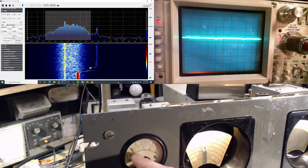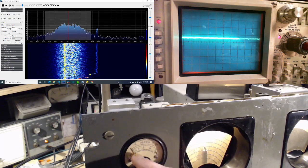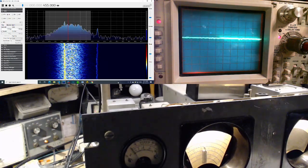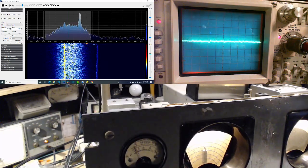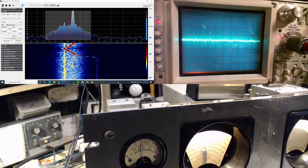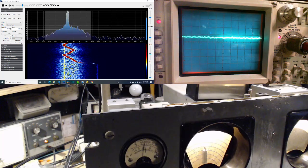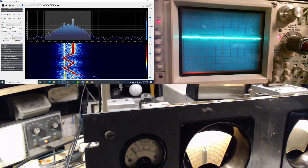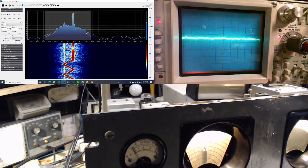And what happened up on the, my signal generator is drifting. Let me just fool around here a bit. Yeah, my signal generator has a drift when you change the output with this control anyway. Now there's another way to change the output. This one. It doesn't cause a drift. There you go. Another lesson learned about my